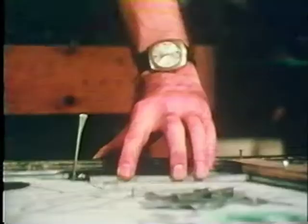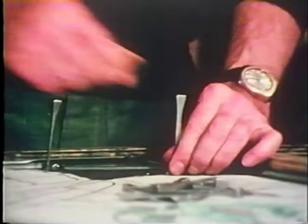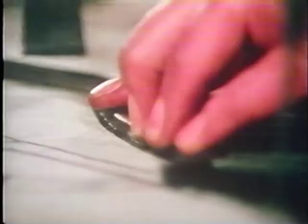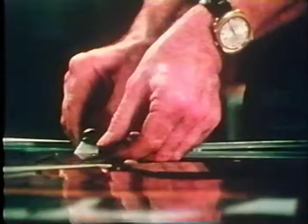The actual glazing, you develop a rhythm of glass, lead, cutting the lead, fitting the lead, more glass, cutting again. And as you speed up in an uninterrupted process, the movement of your hands and tools develops a pattern which is very satisfying and allows your mind to wander and consider the next design that you're about to embark on.